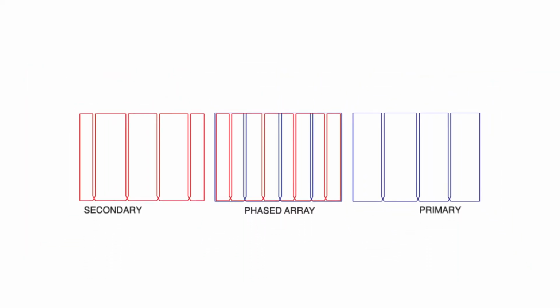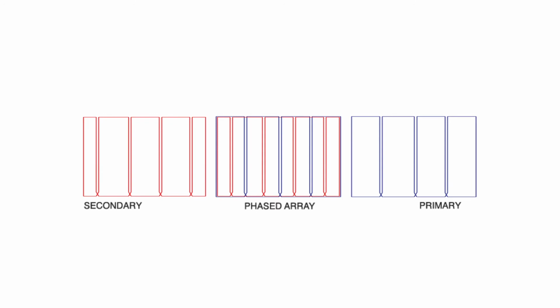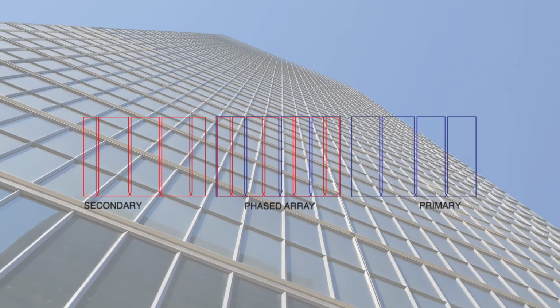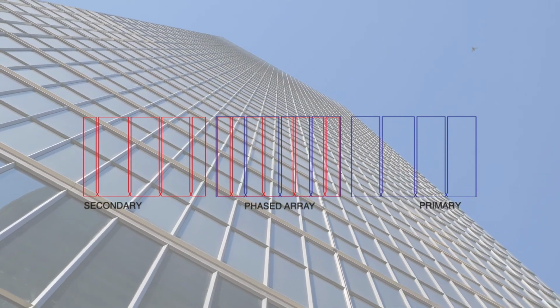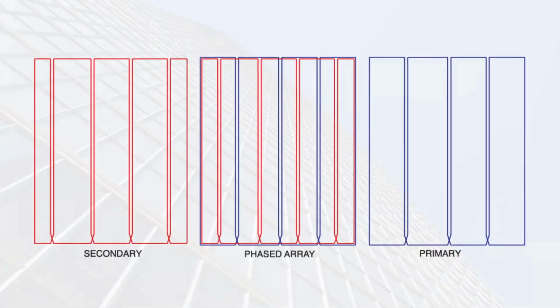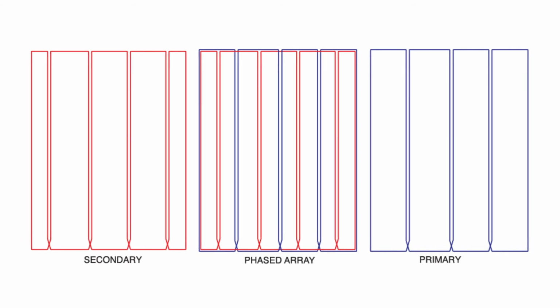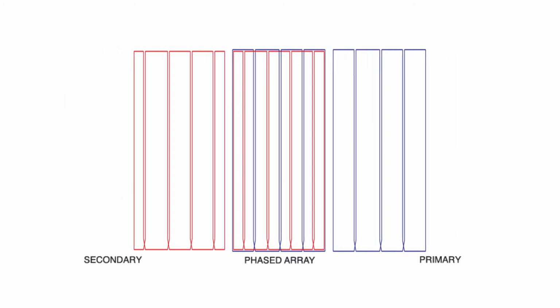Smaller segments will generate better frequency response with less power expended. They will also limit the height above and below the loop antenna. This is necessary for stacked installations where there are loops on multiple floors. The size of the segments are limited on the smaller end by the functional height required for the loop. Very narrow loops will limit the amount of distance the signal will extend up and down.